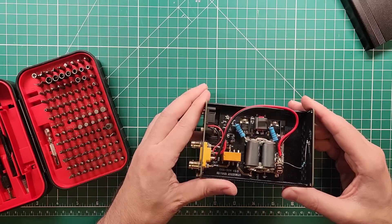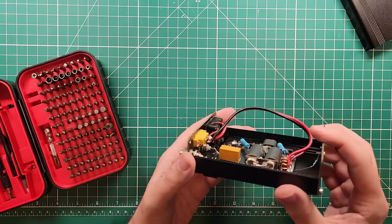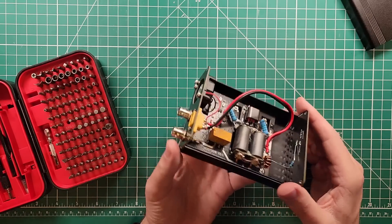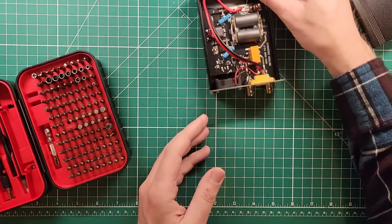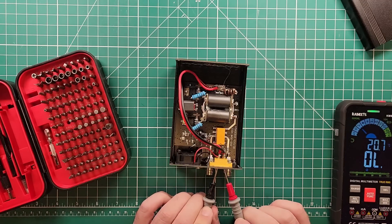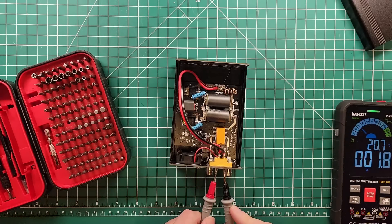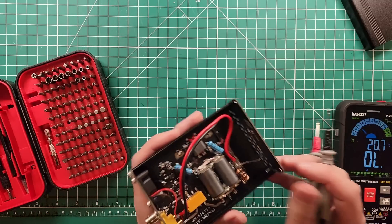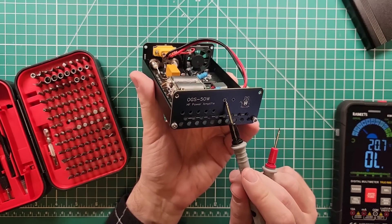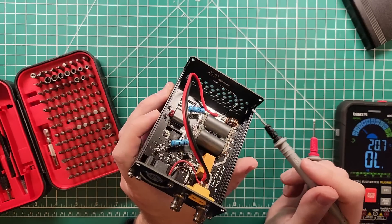There is not a whole heck of a lot going on inside here. So why is it shutting my power supply off? The power wires are barely connected to the XT60 connector. I can see three to two on the binocular toroid there. I wonder why it is shorting out - let's see if it is just a short. We've got the multimeter in beeper mode. Black to black, red to red - there is a short across the power. We were happy there for a hot minute, and then we weren't happy there for a hot minute. The LED on the front panel that gives you your green light is actually a circuit board part, with a resistor that goes out there and ground returning through the screws.